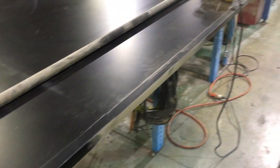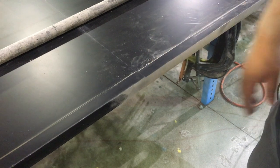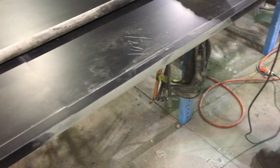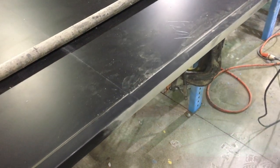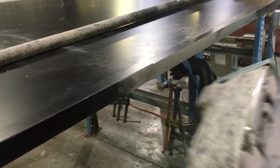On the other hand, if the tops haven't been installed and you have access to the whole bottom of it, you may want to grab your sanders. You can just put it up underneath using a 24 grit sand belt and just flush it out that way.